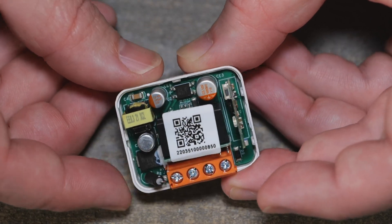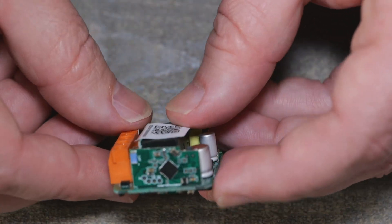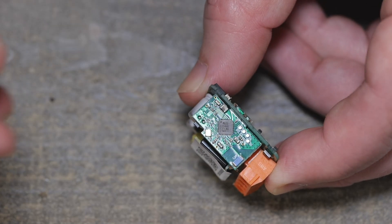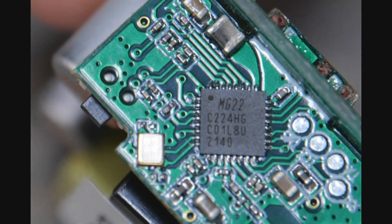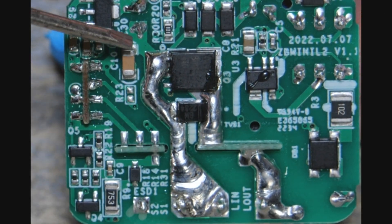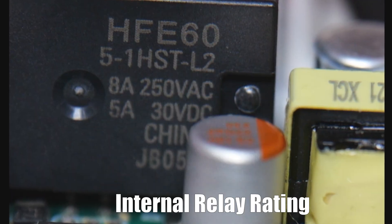So we've got our four terminals. The Zigbee board should just pop straight out. Let's take a closer look at the actual Zigbee board — MG22, interesting. Not too sure about the MG22; we do know the MG21 — that's a Silicon Labs EFR chip. Pretty interesting. Of course, you don't flash these things, they really don't need it. I'm hoping they do have over-the-air update enabled this time around. The line is going in, but I'm not seeing a fuse.